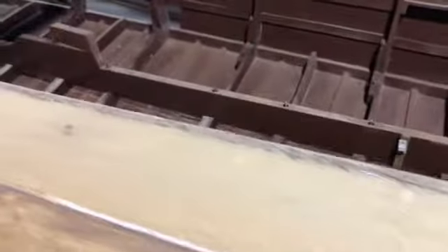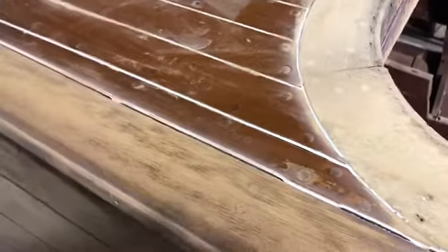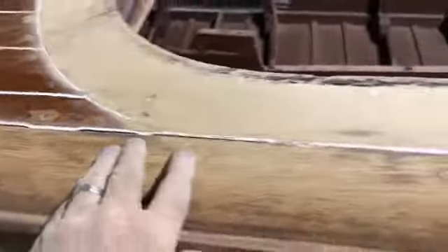I've given this a quick sand just to understand how hard this varnish is going to be to get off, and it certainly looks like it's going to be a bit of a job. The planks are pretty much as we had them — this lower plank was off when we did the 5200 bottom, and we've got all new chines on there, which is good. The boat has certainly moved a bit over summer, but they are what they are.